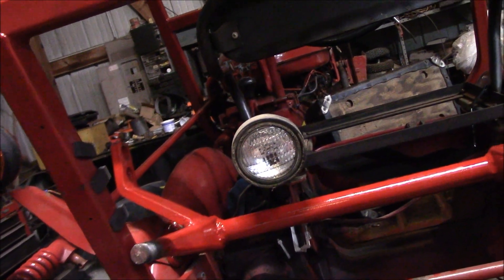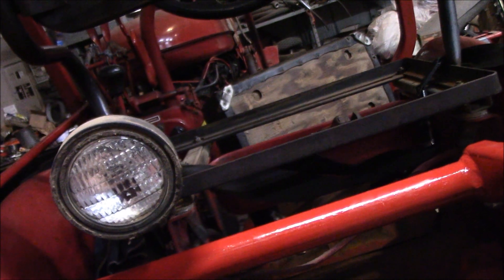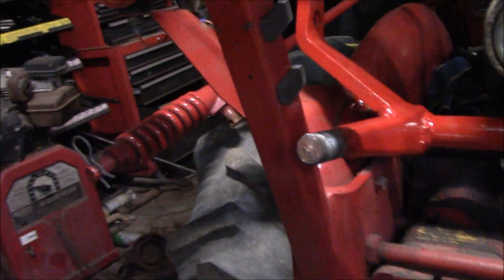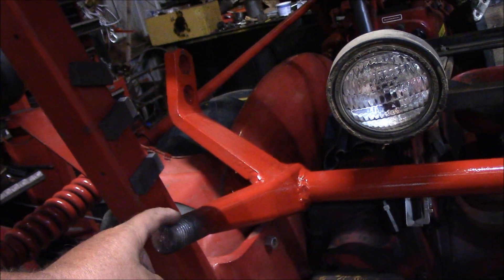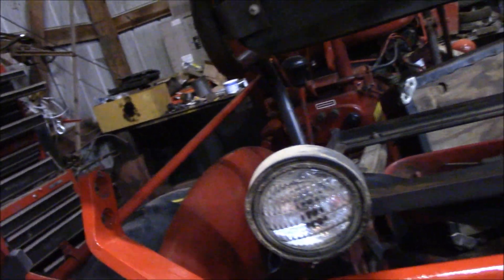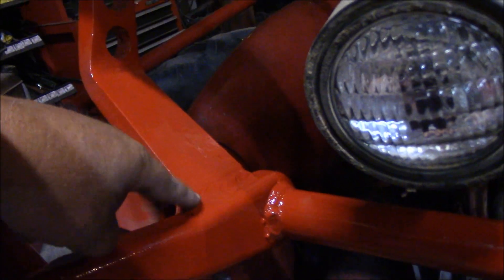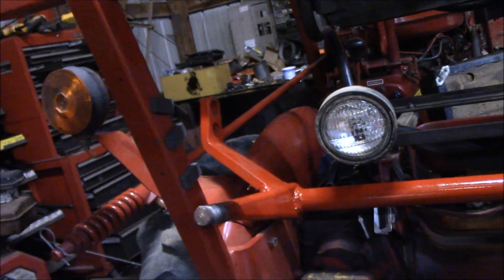This video is titled 'One Point Fast Hitch Improvement on the 79 140 with the Roll Bar.' The previous one that was on here had some wear — typical 140 wear right here in these threads — and in here it was worn, so I found another one that wasn't cracked. That's the big thing — they tend to crack right along in here. The fast hitch was great, but it had its downfalls. There were too many moving pivot points.